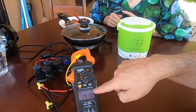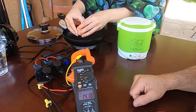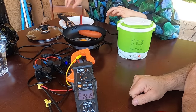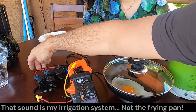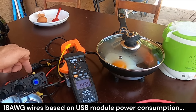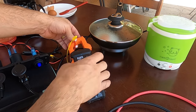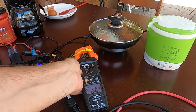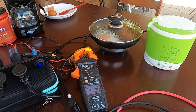We're pulling just over 14 amps, and the wires back here are almost hot to the touch. Everything is at its limit — the buck converter is at its limit, the solar panel is at its limit, and these wires are at their limit. The socket may be good for 250 watts but the wires going to it are definitely not. About 30 minutes in and we're at 14.96 amps — reaching 15 amps. I'm trying to keep airflow on these wires so they don't burn up.